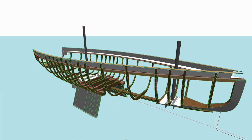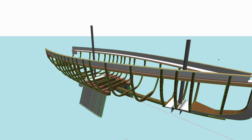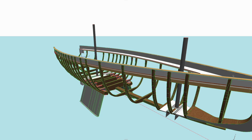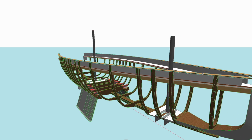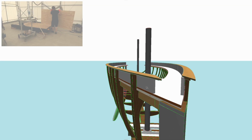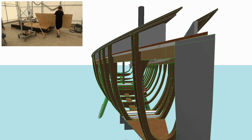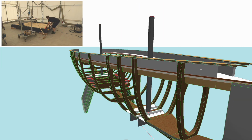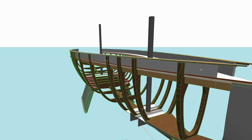And on the top side you can see these bulwark boards. These are the boards the boat will be built on to the floor, so it is completely straight with the water level. And underneath that there is the side decks, and under those are the clamp moldings, which are longitudinal beams that go from the stem to the stern. And of course there is additional structures around the mast steps.